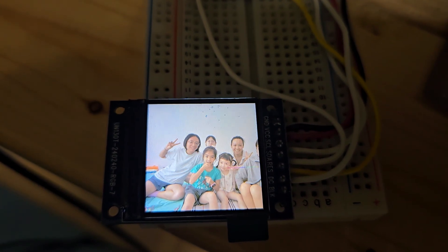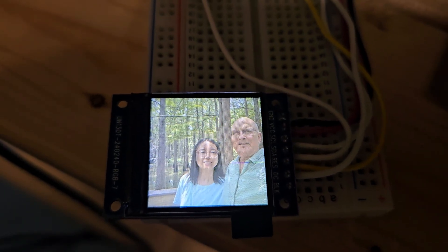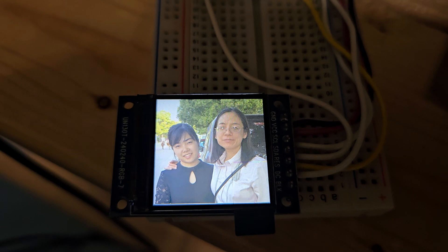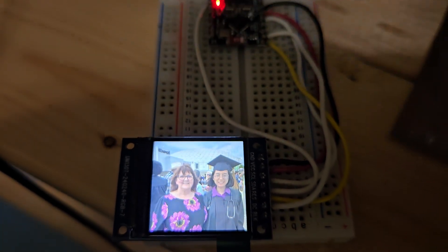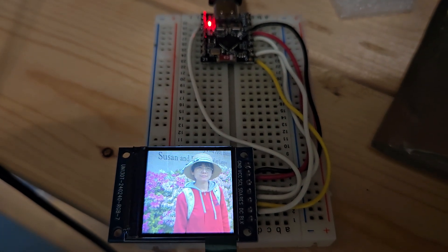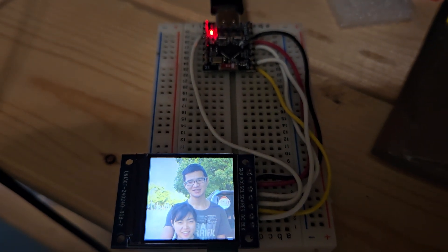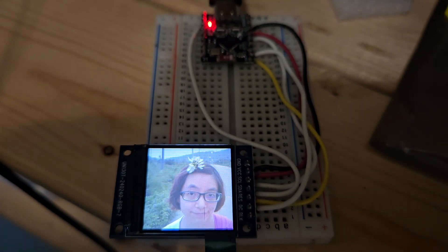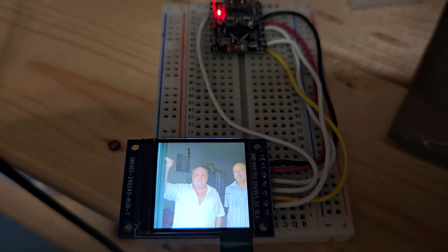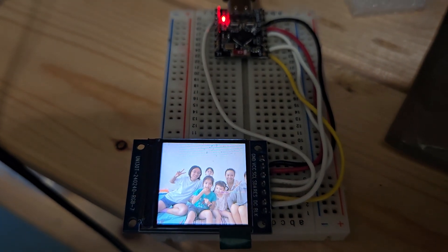After messing with that, all the pictures end up being in hexadecimal format and they load like that. The only way to get pictures on here is to load them through the interface. It actually has Wi-Fi, but they still have to be uploaded as a .C file. I was looking at SPIFFS — that's another idea, using that file system technique instead of uploading bitmaps.